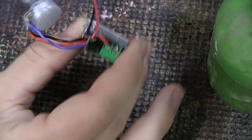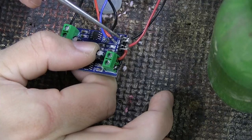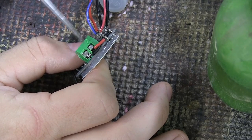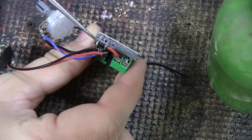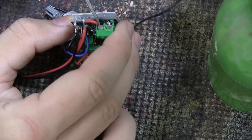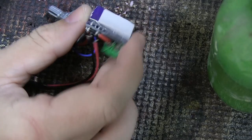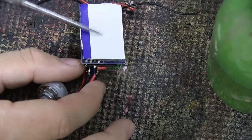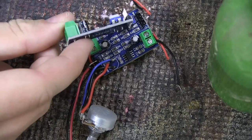I've bent all the legs to stick out horizontally — they are no longer pointing straight up. I bent them into an L-shape so the whole assembly is as flat as possible inside the pedal enclosure. You don't need to bend them; they will work anyway. The ground connection is bent under and pushed under the board, using the leg bent over like a little hook to clamp the wire in place before soldering. I've done the same to the output of the first PCB. I've also covered everything in superglue and put a piece of cardboard underneath so nothing bends, and a dab of superglue along the middle glues the two boards side by side.